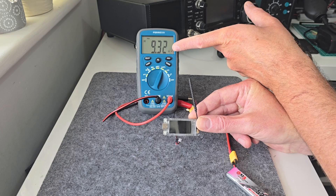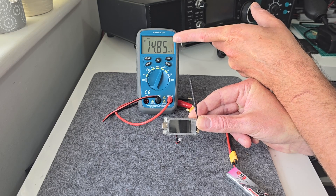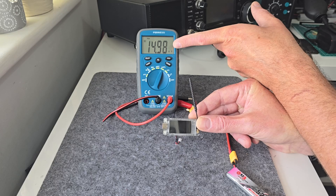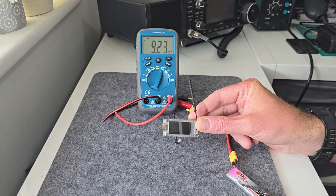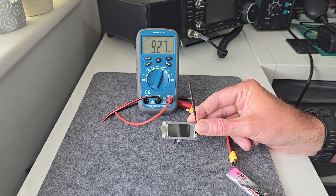So you'd expect this to fall quite a bit as the device settles down after first boot. Look — there you go, 9 milliamps, and then it's peaking up. I'm not sure what this is — it kind of flicks between 9 and 15 for a bit, but it should settle around 9. I've seen around 9 before, which is pretty low. When you compare this to the previous Heltec, it is incredibly low just for an idle current.